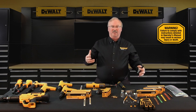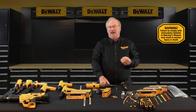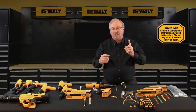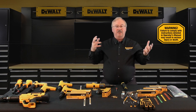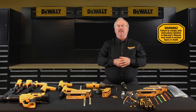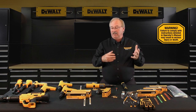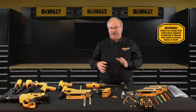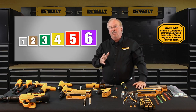Use of the proper power level is critical to the success of powder actuated fastening. To select the proper power level, always make a test firing by starting with the lowest power level recommended for the tool you intend to use. Don't use any other type of load other than the ones suited for your particular tool, and be sure to use only the caliber of load designed to fit the tool. Failure to follow these instructions can cause accidental load discharge, damage to the tool, and may cause serious injury to the operator or bystanders.